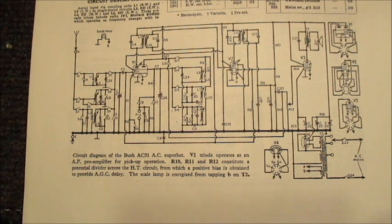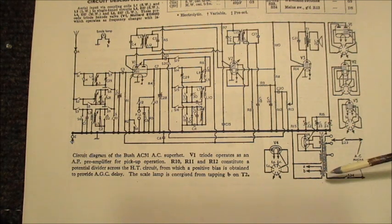The 300 volts RMS, being the step-up or high tension supply, is fed directly to both anodes of the EZ40. The EZ40 is a full-wave rectifier, but both anodes have been strapped together, so it has been configured for half-wave rectification. Its 6.3 volt heater supply, as well as the 6.3 volt heater supply for the rest of the valve heaters plus the dial light, are via step-down secondary windings.